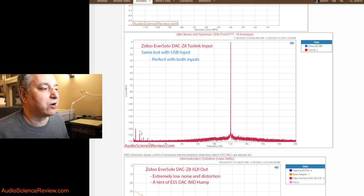And embedded in there is a little square wave that generates these spikes. So it's a 24-bit level. These bits in here, an ideal DAC would have low enough noise floor in here where you see the sequence of little spikes showing up. So these are not bad things. This is actually desired, these little spikes over here that start at minus 140 and go down. So we want to see a noise floor that's this clean in here. We don't want to see any other spikes in here. If you squint, you see some tiny things in here, but they're just incredibly low level at minus 150. We just absolutely don't care. So this I call perfect.